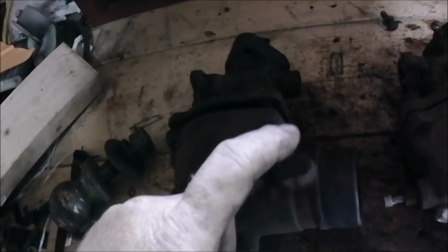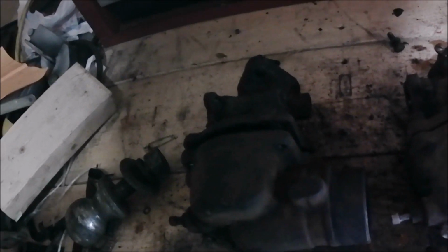When you get a crack in a float like this, it'll give you nothing but nightmares, so better fix her right. Okay. The carburetor to the left, I did find another carburetor, but slightly different. This is a Super W6 carburetor, and this is a 400 carburetor. The regular W6, the choke's on this side, on the outside, and the Super's on the inside, as with the 400. But the bowl should be the same, but the big difference is this screw here is down here on the Super 6 carburetor.